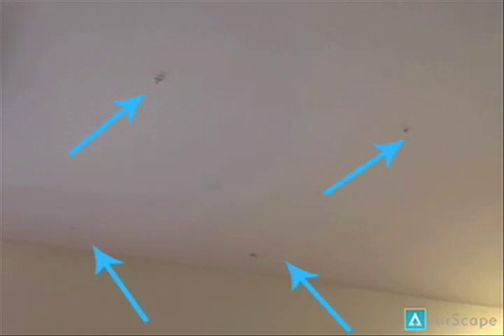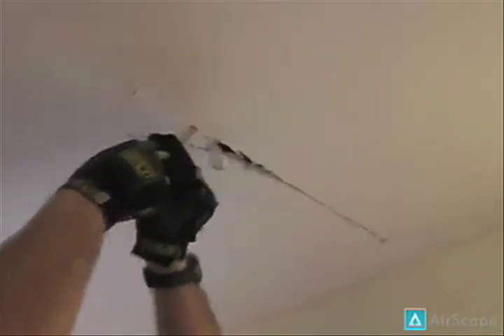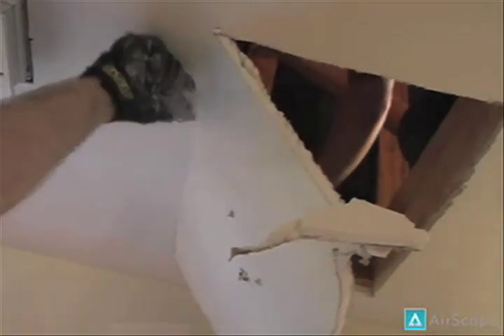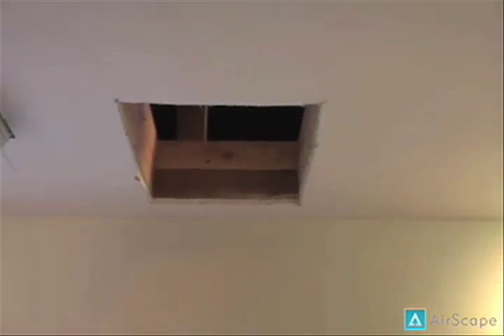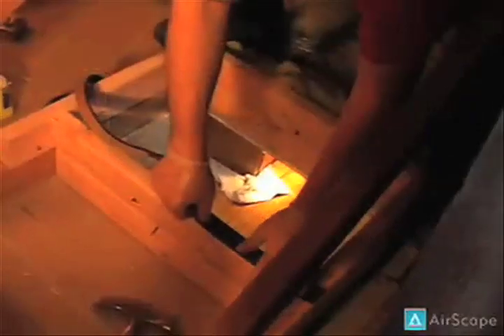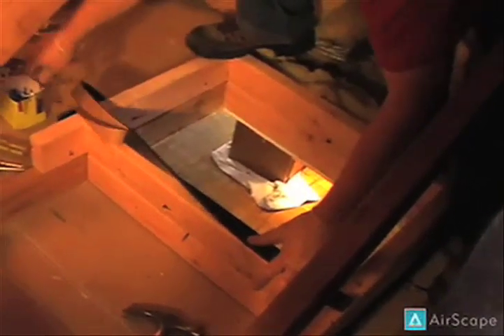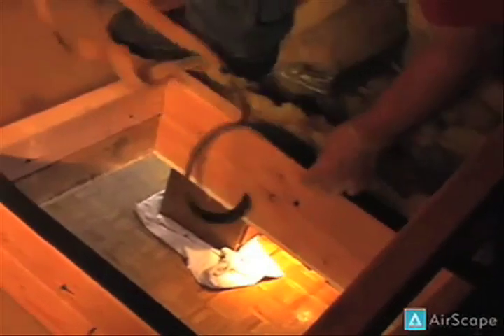As you can see here, we've marked our grill opening at four designated points using nails from the top. When you're ready, carefully cut out the grill opening and remove the drywall. This is what the hole should look like — notice that it is within the framing we've constructed for our fan. Next, install the included gasketing over the top of your framing. This will help minimize the vibration created by the fan.